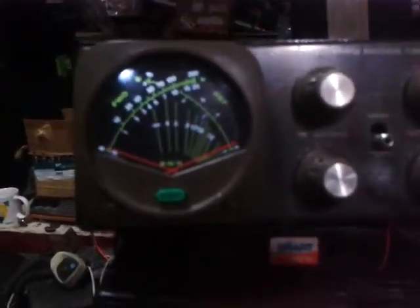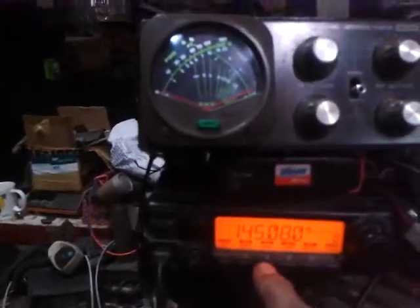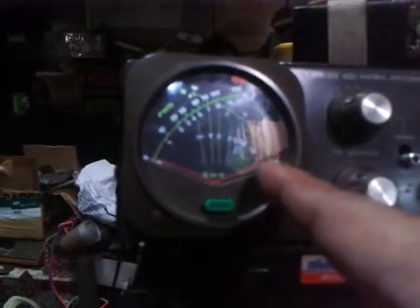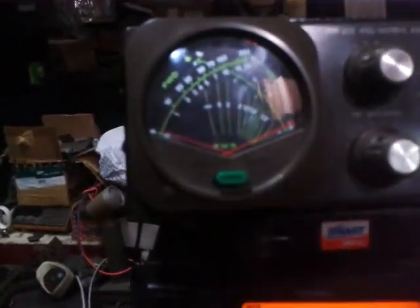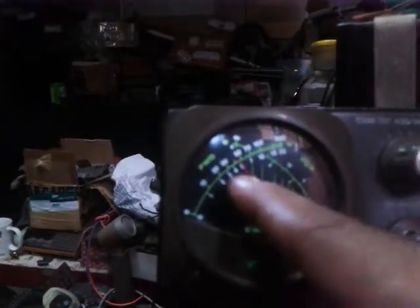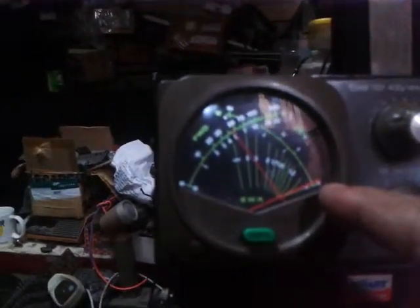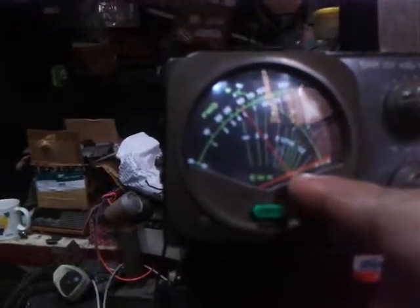Same with the UHF — if you are using a UHF radio, you have to first adjust the TR matching, then the antenna matching. Let's go back to the low power portion, up to 20 watts, so the reading will be 0 to 20 and the lower reflected power is 1 to 2. On low power we got a 5-watt reading, with zero deflection on the reflected power and a 1.1 SWR.